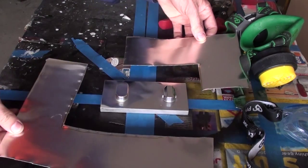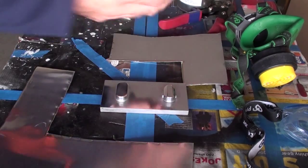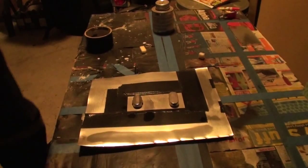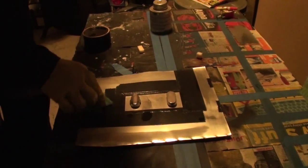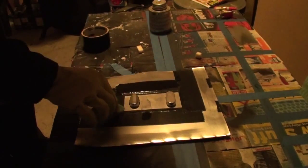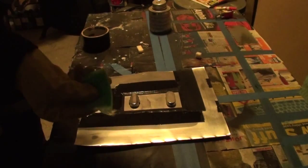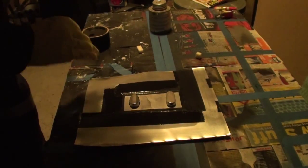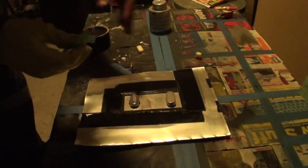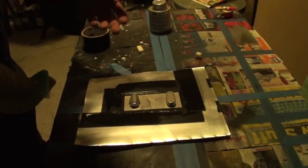They will just both come off easily. This tin will also need to have release agent on it so that it too gets released from the mold. This is the last coat. First you have the sealant, and then this slip agent goes on top of the sealant. So once the mold is on top of this, it will just come right off with relative ease.